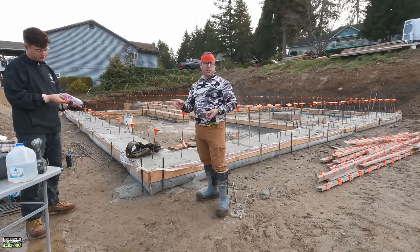Here I am using my sweet six-year-old Martinez M1 hammer — probably the world's most expensive hammer, but what I feel is the best hammer ever invented. Not just saying that, I love this hammer. I think I'm going to buy a special one with special colors and then never use it. We're just using up those dupes — you get about one to two inches in, that is all we need. The concrete is still green enough because it's been less than 24 hours since we placed it.